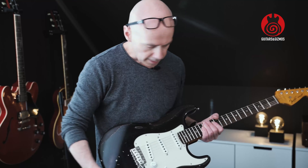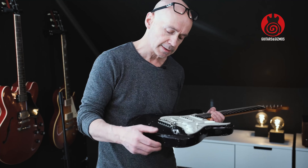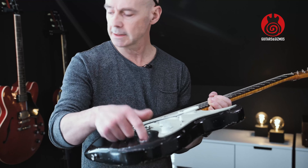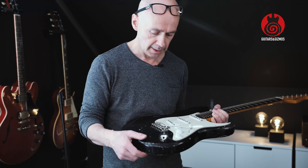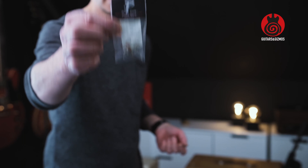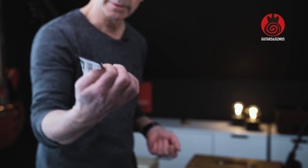There are a couple of ways you can try to fix this. I've seen some guys use steel wool or sandpaper to clean up the contacts in the old jack output. But instead I will use this — a multi-contact output jack from Pure Tone.